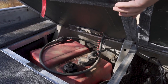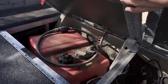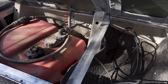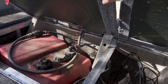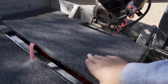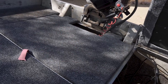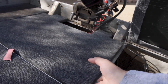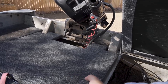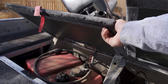Getting into the back section of the boat — there's the big gas tank, a six-gallon. It's a two-stroke, so I have to pre-mix all the fuel. You can see the framing is going back in there and I have two legs against the transom — it's a reinforced transom. With this hatch, I made it opening one way instead of the other. I didn't want to be filling up my gas with it opening toward the tiller and potentially hitting it, so opening it the other way was a better idea.